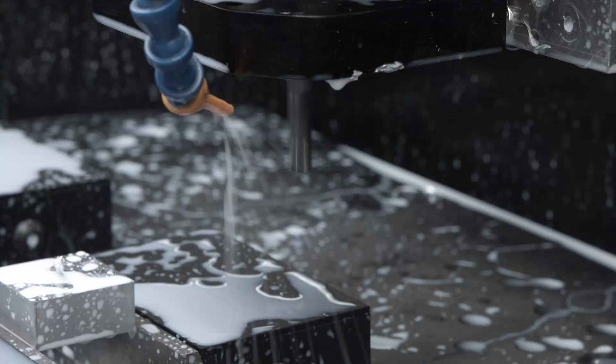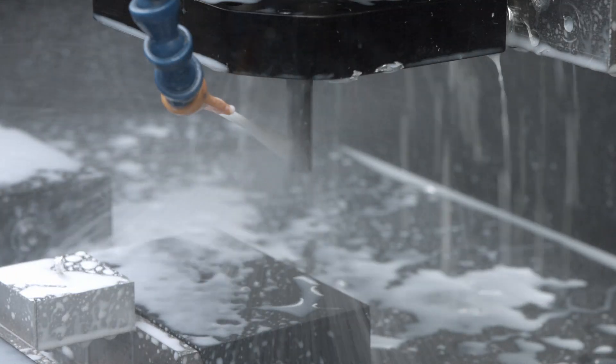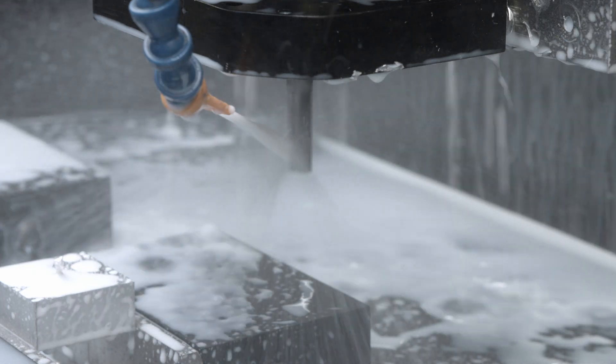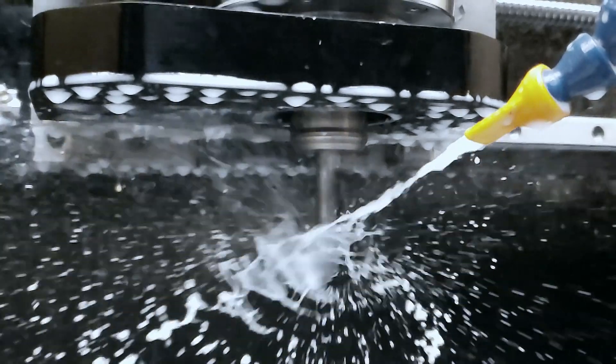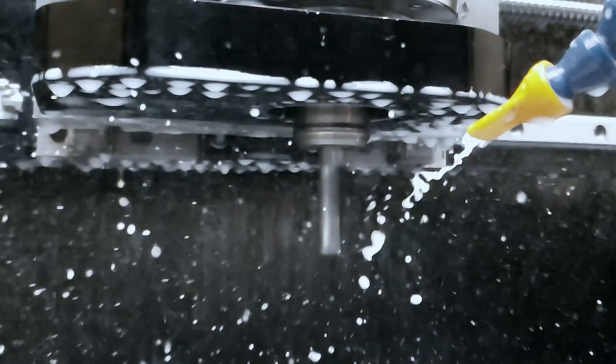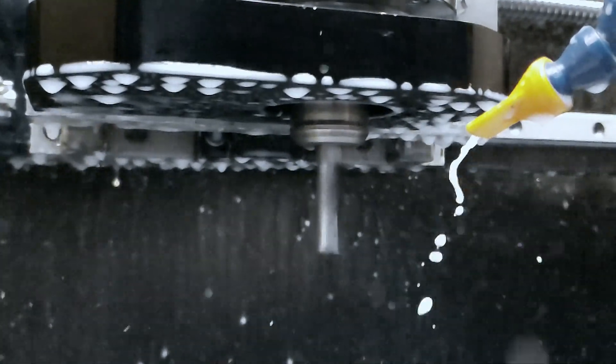When you open the door you don't breathe dirty air. In the case of CNC, when the coolant hits a fast-spinning end mill, the end mill atomizes the coolant into tiny particles and they float. I want to show you that in some slow-motion footage — take a look on the left or right side against the black background at the amount of drops floating in the air.